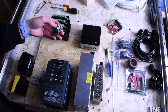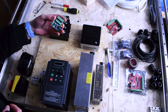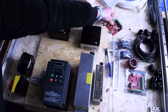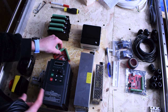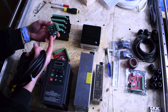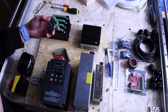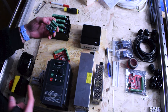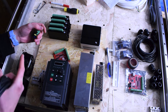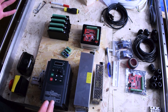I've also received delivery of the PWM to analog converter board — the one that acts as a middleman between the Mach 3 board and the VFD. It takes a PWM signal in and outputs an equivalent analog voltage, making sure we can communicate properly with the VFD rather than trying to drive a PWM signal straight in.